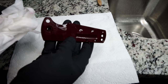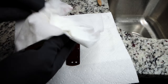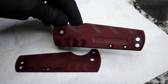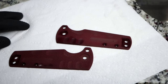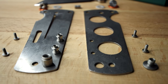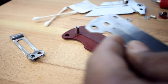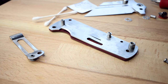I've heard many different things from different people — from don't touch the scales for 36 hours plus, some say 24 hours — and it really doesn't matter, it's whatever you prefer. Personally, I've always moved to step seven after about eight hours have passed. And step seven, of course, is reassembly. I always sit my screws out in the layout and fashion in which they were taken out, meaning I put my left screws back on the left side, exactly back in the holes and thread they came out of. Even if they are the same size, I try not to move anything around from how it was set. If you need to take pictures, do whatever makes you feel comfortable with the disassembly and reassembly process.